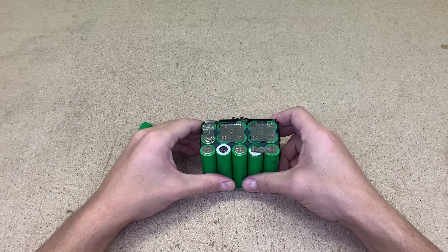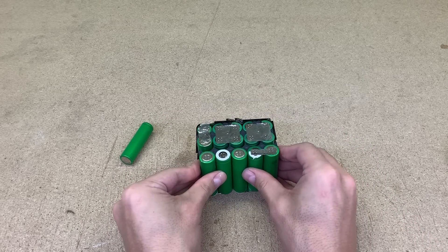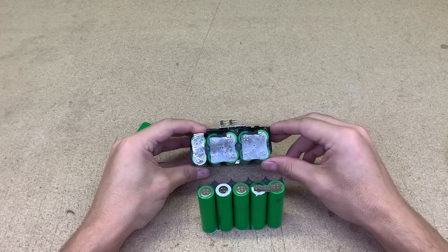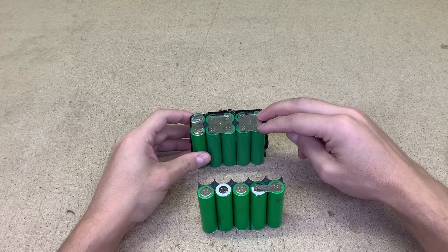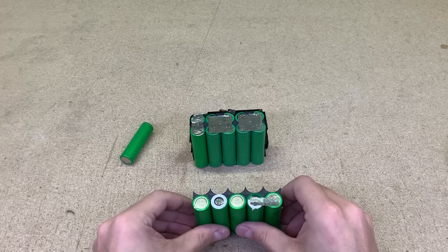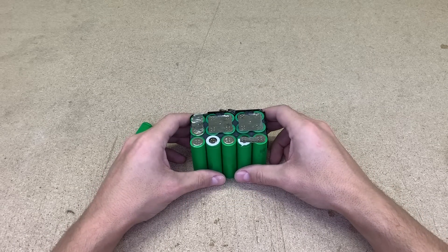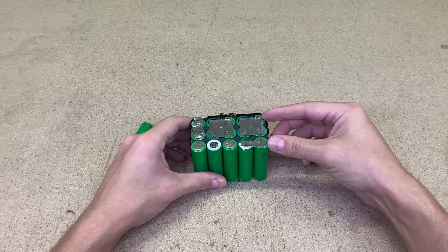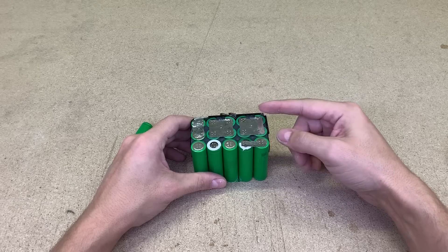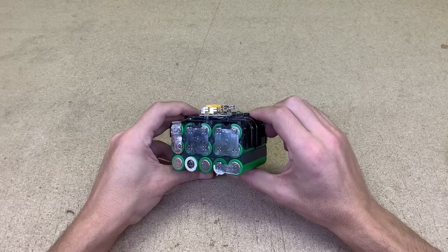Let's talk about the pros and cons of this mod. When the battery is used on a very powerful tool like a leaf blower, string trimmer or something else, it will continuously drain a high amount of current. Let's say our tool at full power requires 20A of current. This current will split into those 2 cells connected in parallel, which means each cell will get 10A of load. Continuous high amperage will cause battery cells heating, fast discharge and shorter battery life. By adding a third row in parallel and requesting the same 20A of current, we are splitting all load into 3 cells connected in parallel. Now each cell will get only 6.6A — that is 33% less load than a 2 parallel cell configuration.